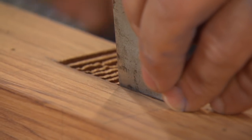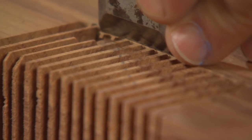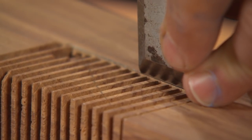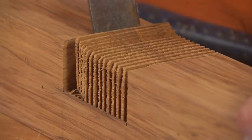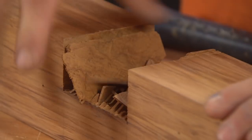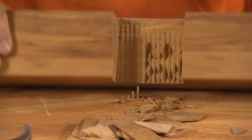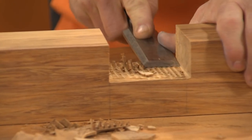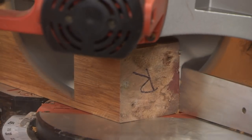Let's just go on our line there, flip that over, and do exactly the same on the other side. When you're using a chisel, just make sure you've got your flat part of your chisel on your line and the bevel of your chisel facing out. Now we've set all that up, let's just gently knock all these over and then finish that up with our chisel. Come from each side — that way you're not going to blow it out. With a nice sharp chisel, let's just finish that off by hand. That's looking pretty good. Time to cut the shape on the ends of our legs.